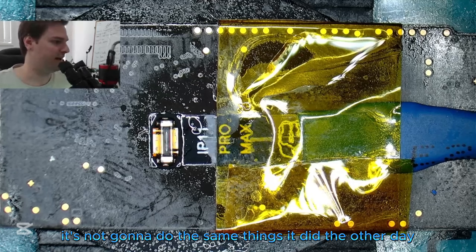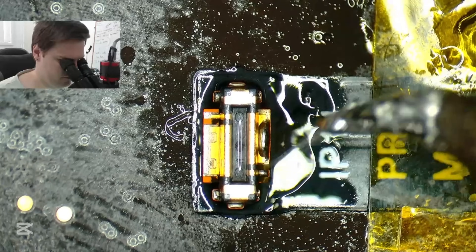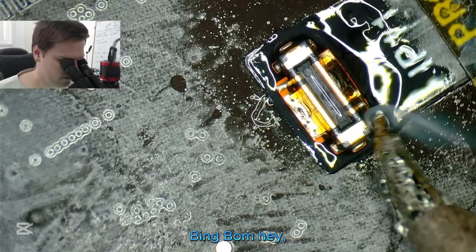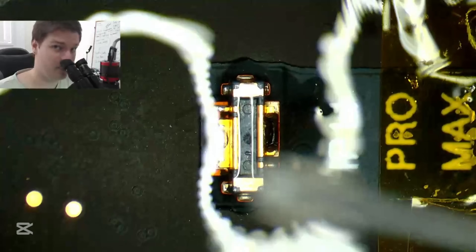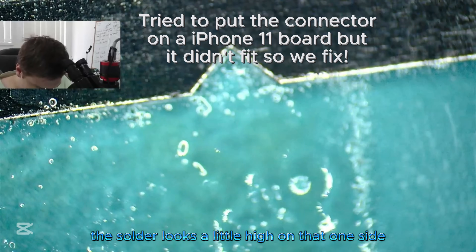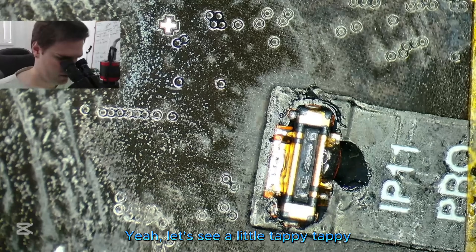I have to find a position where I can see and you can see. Clean the guy up — alcohol usually helps. I have an iPhone 11 board here, see if it works. The solder looks a little high on that one side. I'm gonna come back in just with the soldering iron, just tap it. What happens with flux — you put it down, it just keeps oozing out, you wipe it off, sometimes too much comes with it. A little tappy tappy.